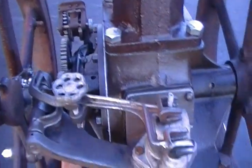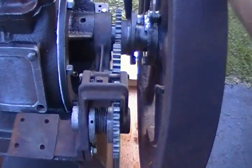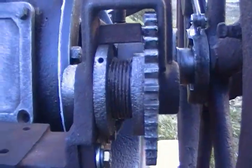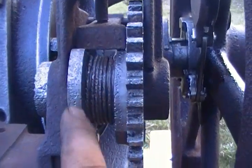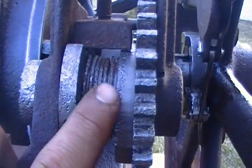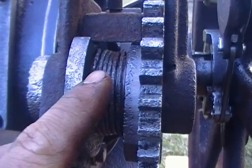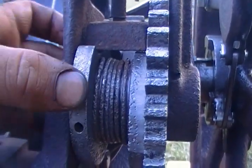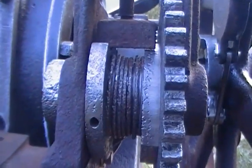I got these gears cleaned up and figured out the magneto drive. It's pretty neat — it's got an external mag impulse. When you turn it over slowly, these two gears ride on a central shaft, and there's a cog behind this spring that rotates. I'll just show you how it operates.